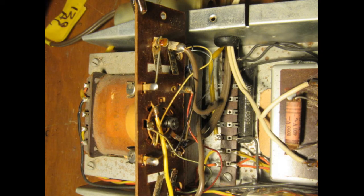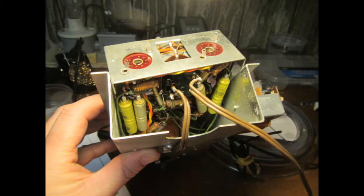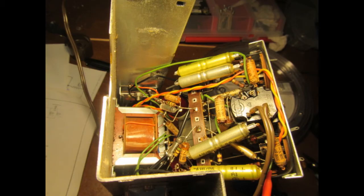With a little more access to the amp, I took the opportunity to check some of the resistor values. Most were on the high side, and only one was way out — that I've marked for replacement. Given that modern line voltage is well above the original 110-volt design, I think these higher resistor values are not going to matter very much in the end.